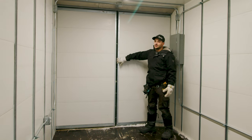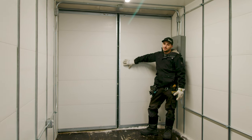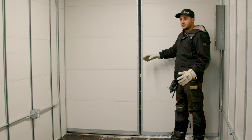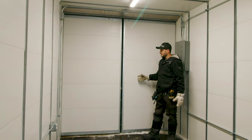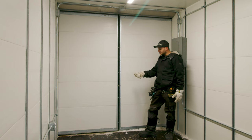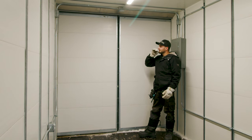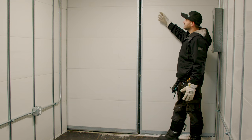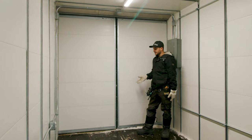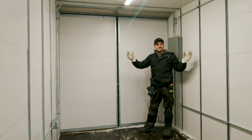This is how our container door flashing kit looks when it's all buttoned up. It allows us to achieve very good insulation on the shipping container doors and line them with the same interior lining as inside the container. If you spray foam across the doors without this kit, the doors don't work properly when you close them. This kit keeps the doors extremely operational while still providing the best insulation possible — about as insulated as your garage at home, compared to the rest of the container which is as insulated as your home.